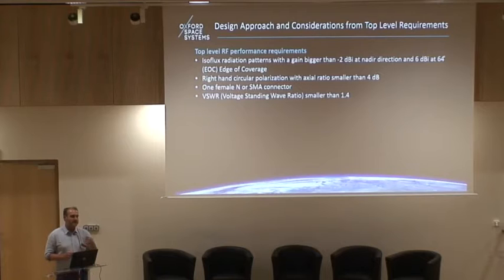And that's driven both from technical reasons, but also from license compliance reasons. You can't bombard certain areas of the Earth with a certain level of radiation energy. You'd simply overload those central areas, so you've got to control the level of energy. So that puts a lot of challenges, actually, on the structure as an antenna.